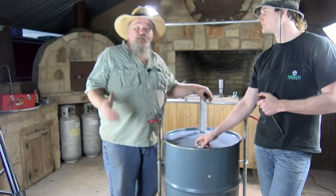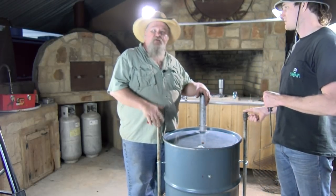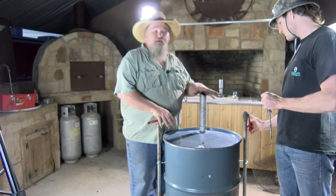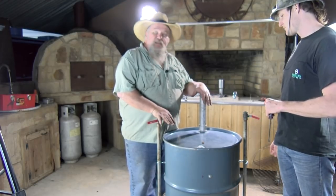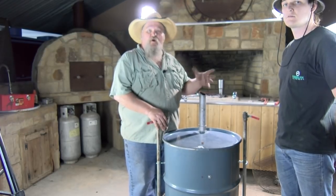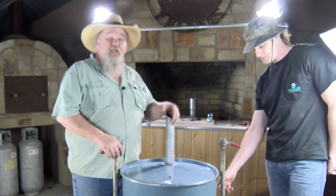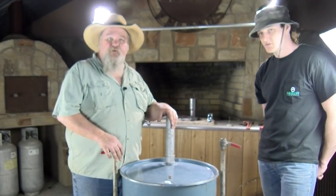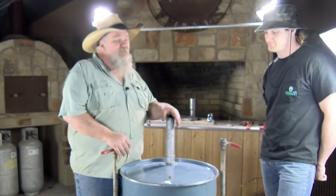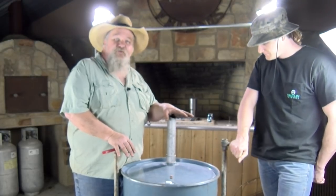By putting these air valves, when you get like me and you don't want to bend over all the time, you can just open it up and that'll let your heat go up, close that air off, let it go down. And remember, we have the two lower ones down low so that you can take the caps off and leave those open all the time or leave them shut all the time. But with that, you get plenty of airflow. An inch and a half — keep your pipes below your exhaust. And if you go to a lot of places, they will cut these off. They'll make like one cut for free. Some people just buy two feet ones cause they sell them there. But if you have them cut them for you, they'll cut them off lower and they'll thread them also. But easy, simple, not hard. It took us one afternoon and a run to the hardware store. Really all in all two hours work time, maybe two hours by the time we took everything apart and put this together, definitely less than three, but it was easy.